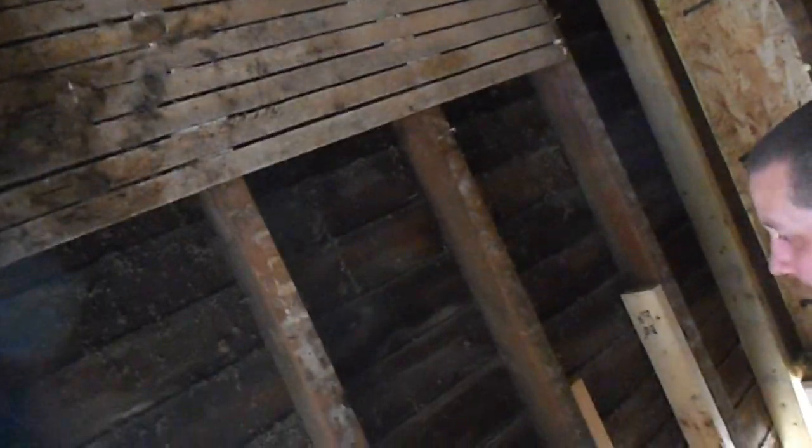You could just put the insulation in and leave it like that. I'd tear out the rest of these boards, then insulate it, put the insulation in, the vapor barrier, put the floor boards down, sheetrock — you'd never know the difference, it'd be good.